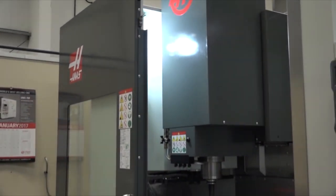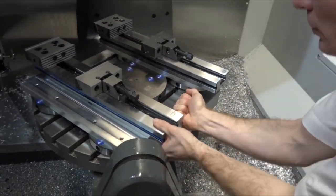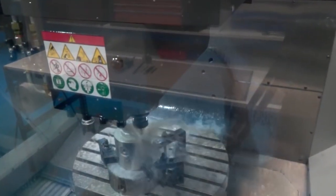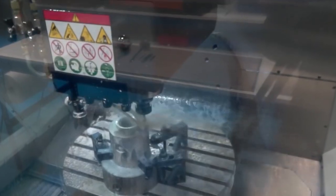We can split operations down now so we can do a full operation using just two ops. Wherever that table moves, wherever it swings or twists, the machine automatically works out the figures to keep everything working around one datum.